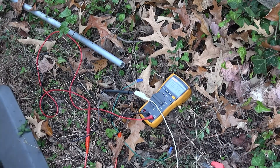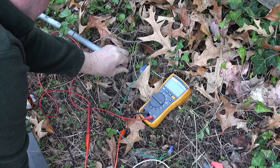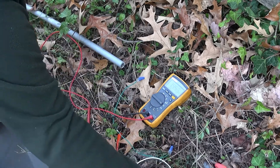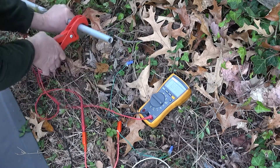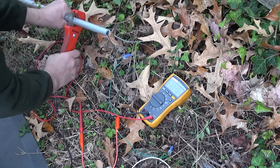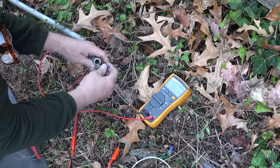I confirmed that where this conduit has opened up, the wire connection is okay. I'm now connecting to the other side of the loop and it's reading 0.9 ohms. But I can see if I play around with the wire it goes all the way down to like 20-some ohms. I believe what happened is the wire got pulled right inside of here. So I'm going to cut this conduit back a little bit — I want to cut the conduit but not the wire — so I can pull it out.